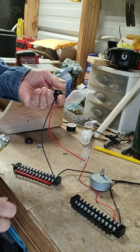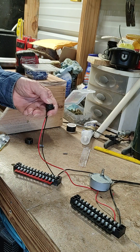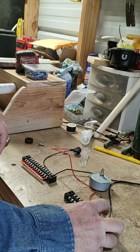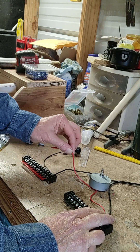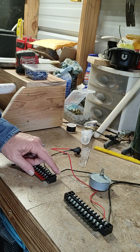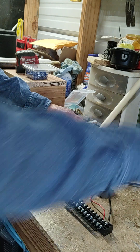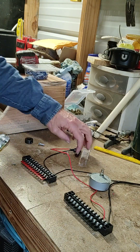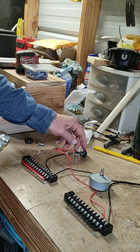That's why your switch will work — what it does, it just breaks the circuit, and then it'll come back on. Just remember: one wire will go to the one power source on the motor; the other wire goes to the switch. Then you put the other power source wire on the other side of the switch, so it makes a circle. You don't want them to go together, because then it'll trip a breaker or whatever.